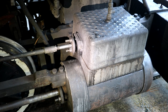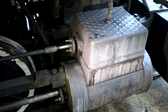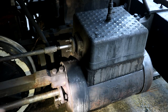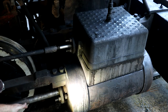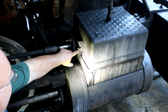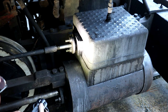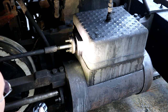What we're looking at here is the actual steam engine on the right side of the locomotive. There is a steam engine in that cylinder down there, and that's what powers the drivers or the wheels on this right side of the locomotive. Down here at the bottom is the cylinder - this is going to have your piston and stuff up in here. On the top is the valve that goes in here. There's a valve block above that lets the steam in and out, and right here you can see a crack. It's actually worse than it was the other day - they ran the locomotive on Saturday, so it made that a little bit bigger problem, but again, nothing that we can't take care of.